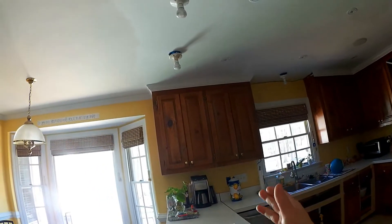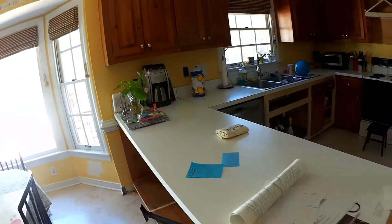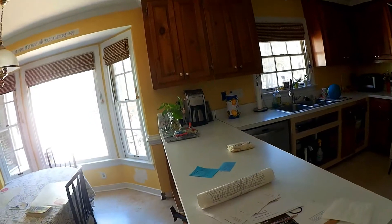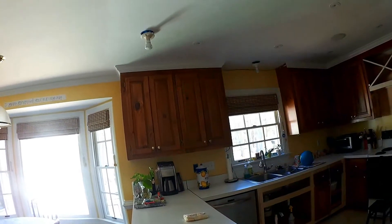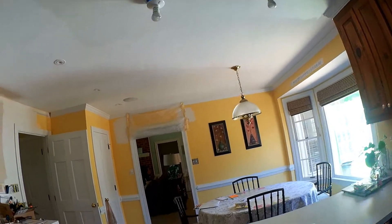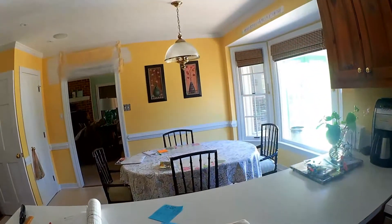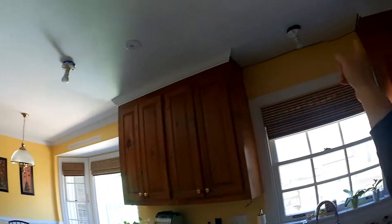The problem I was going to see is that the new countertop is going to come out to this depth, right there. So when I was trying to create where I wanted these lights to be, I wanted them in the middle of this countertop. I ran a plumb bob to figure out exactly where it was going to fall and then fit those boxes in place. I had to move them closer together so that they would line up just inside these areas — where the cooktop will be, that will be my lighting. These will be drop-down lights that match the other drop-down light, so they all tie in together as the overhead lighting for the cooktop.